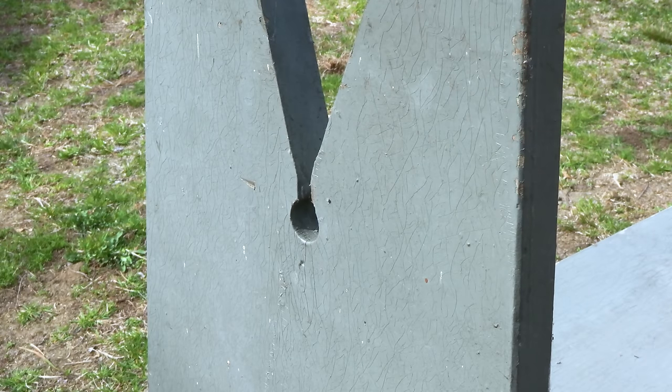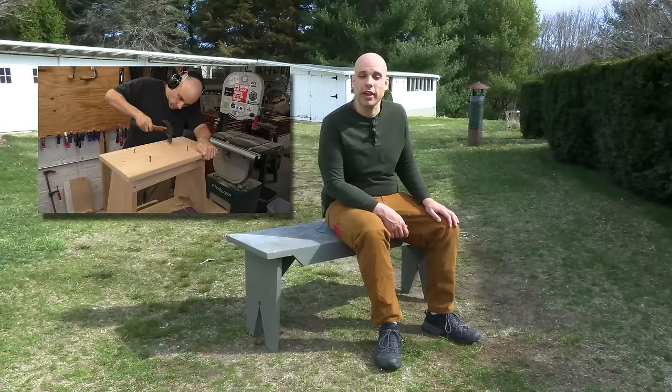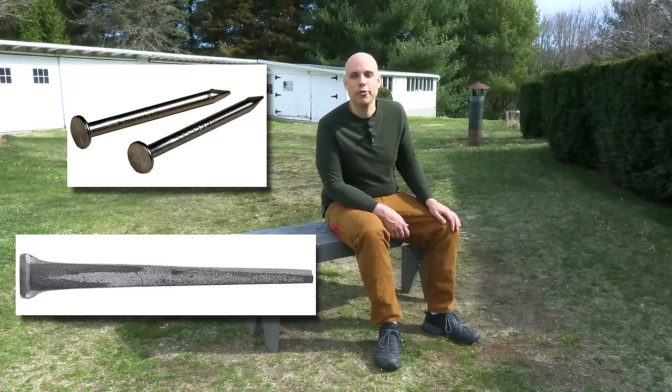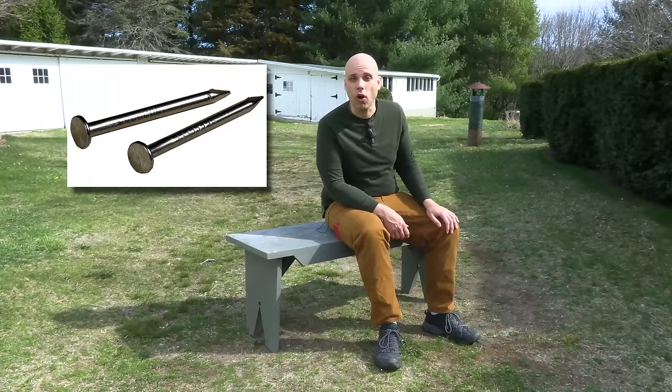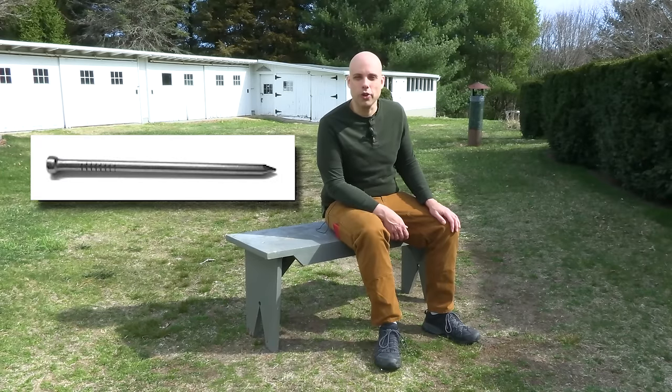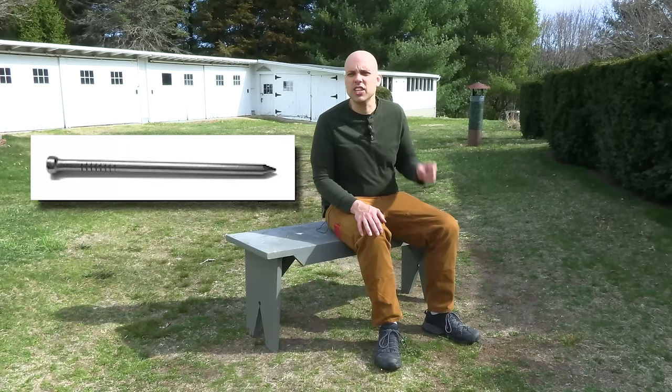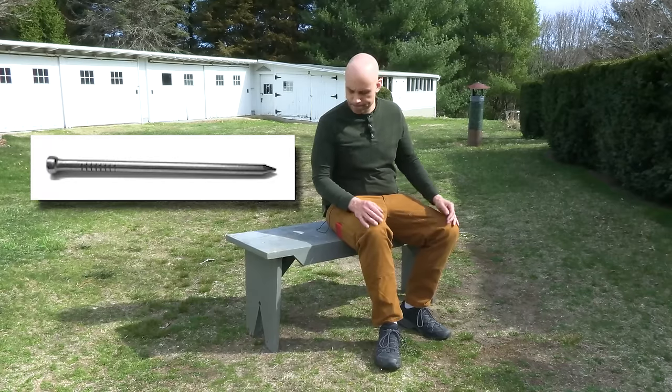The last part of this video might be the best, because it's where I get to eat some humble pie. I've been on YouTube telling people: if you're going to make nailed furniture, use cut nails — don't use wire nails. Well, this bench is pretty darn real, and it doesn't use cut nails. It doesn't use construction nails or roofing nails with a nice big head. It uses skinny little eight-penny finishing nails with basically no head — the last fastener I would use. I know these are the correct nails because I've compared the heads with the nail holes, and I know there wasn't any glue used because I've examined the joints very carefully.